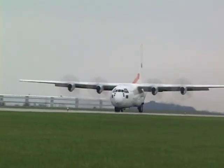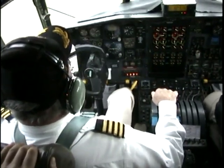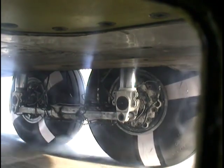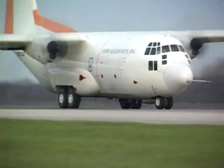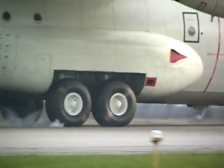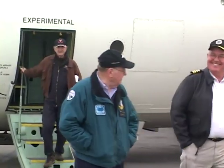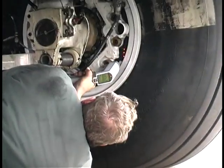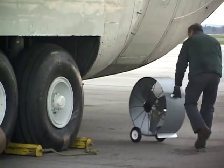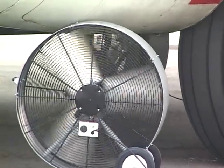Once the testbed's brake system and instrumentation was upgraded, testing began with the steel brakes. The Snow Aviation and General Atomics team worked to capture the steel brakes' performance as baseline data to compare to the Messier-Bugatti carbon-carbon brakes. This testing included a variety of gross weights to represent typical mission weights for the C-130. Rejected takeoff testing included dry runway as well as wet runway conditions. A quick-look data analysis was performed between each data run while waiting for the brakes to cool, to verify proper aircraft brake system operation for each data point and to enhance data comparisons between the steel and carbon brake configurations.